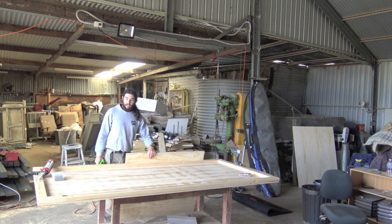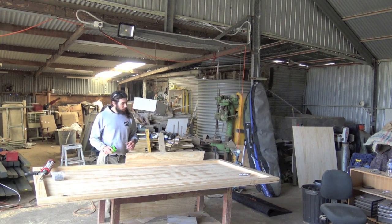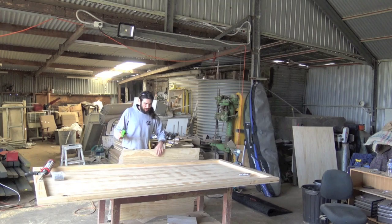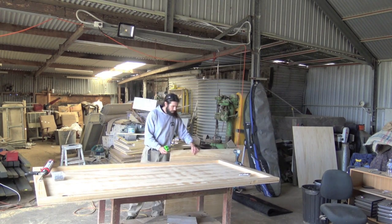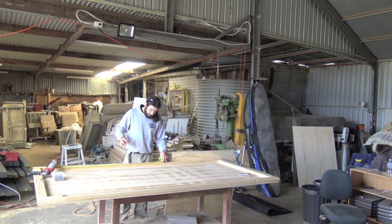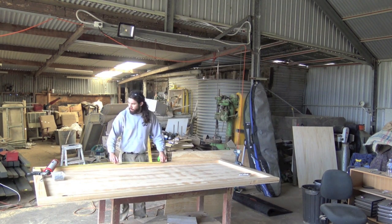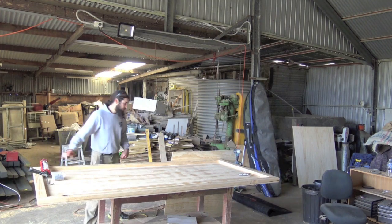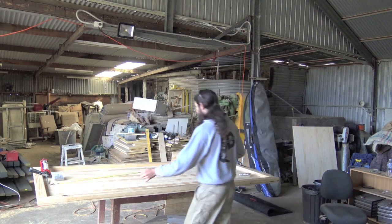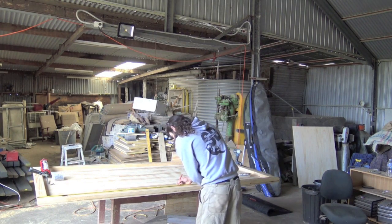Alrighty then, as you can see we've got the timber glued on and screwed on all the way around the outside. It's there to make sure weights don't roll off the platform when you don't want them to, which is always nice. So the next thing to do will be to stick down the standing platform. So just mark in to the center of the sheet on both sides. Probably get away with just doing it on one side, but if you do it on both, you'll know that you get it nice and square.